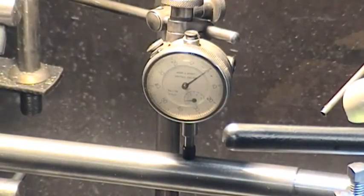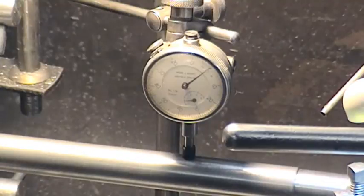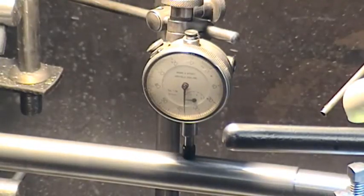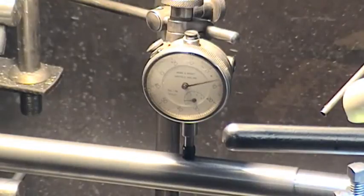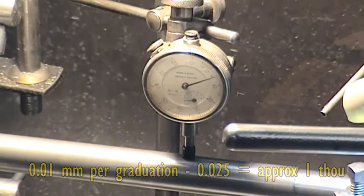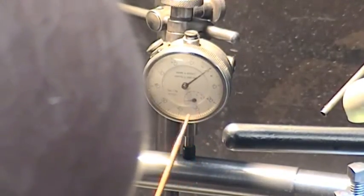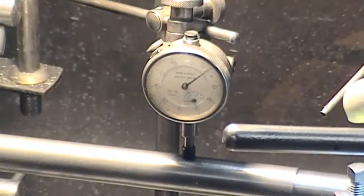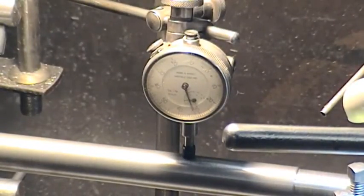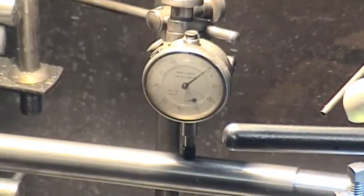I've got a dial gauge on here — it's actually well beyond the midpoint, but the way this bar is distorted, the distortion is probably worse just beyond the halfway. The dial gauge is metric; I've used it for a long time because it has just a little bit more accuracy. You can see here we're going from 0 to 30 — this is 0.01 millimeter. So we've got to soak that up on the business end by using the steady.